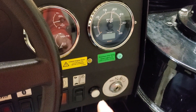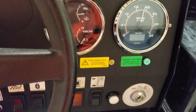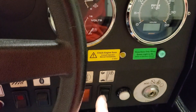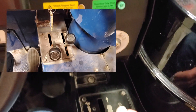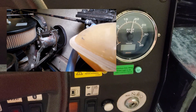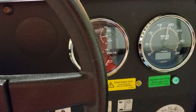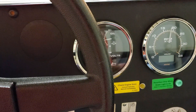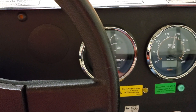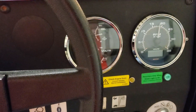I want to talk about setting the engine RPM, because that's the first step of the equation. On this machine, the 546, there's a rocker switch used to set engine speed. On the old 500, there's a lever connected to a cable and carburetor, as well as a mechanical governor that helps maintain engine speed by adding or taking away fuel. Newer machines have electronic governors and electronic throttles — the computer senses load and increases RPM by adding fuel, though the engine does operate independent of load.